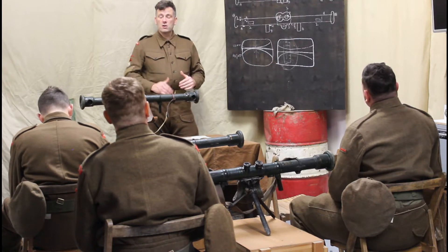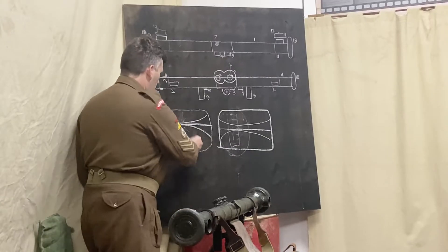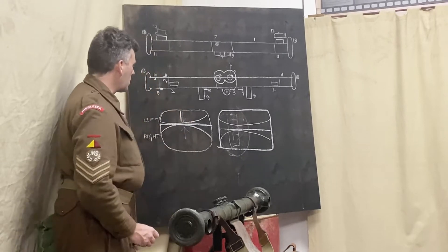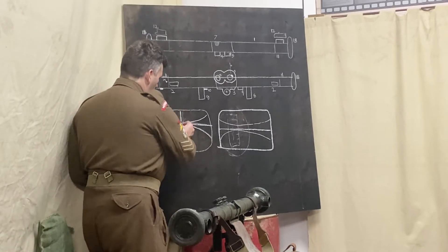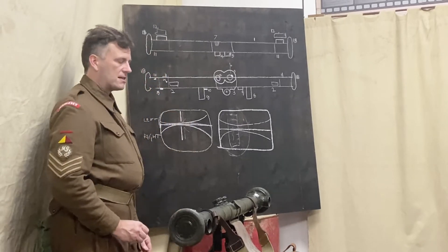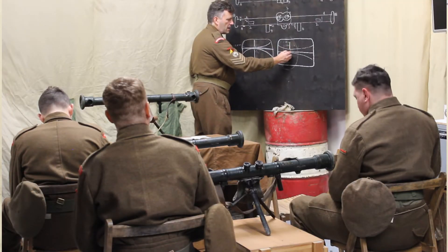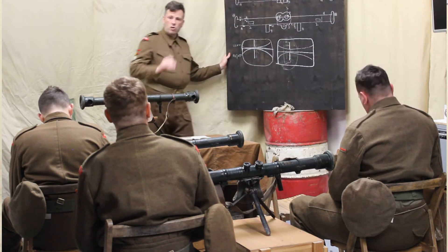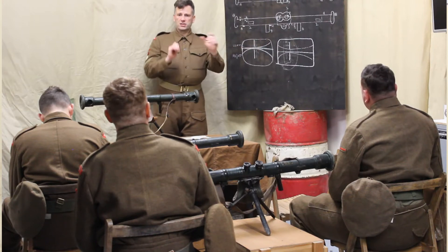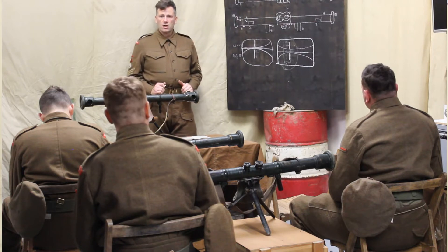What we'll do now is go into the field and try that on our line target. In the case of the line, we'll have the target — the object pole — and correct halving means the top of that will be equal distance either side of the center line. In incorrect halving it would obviously be at different distances from that center line. We'll also try it on some crest lines so you can see how you adjust halving and how the instrument reacts to both types of object you're ranging upon.